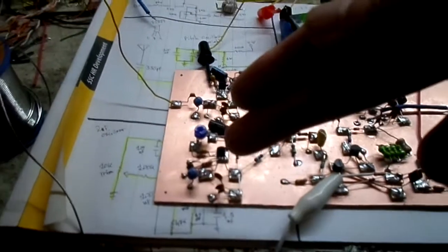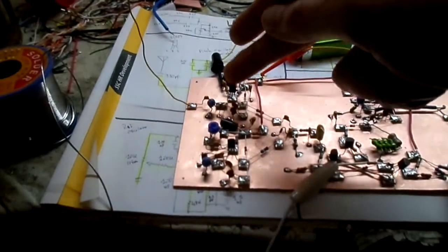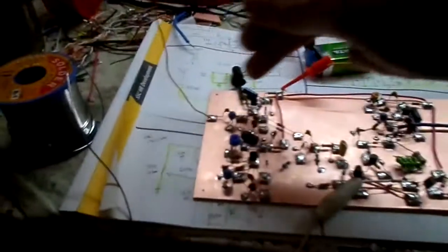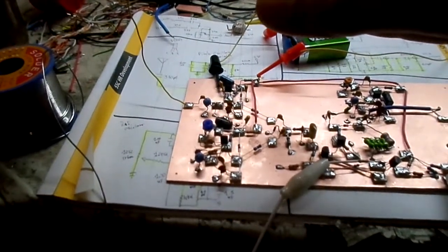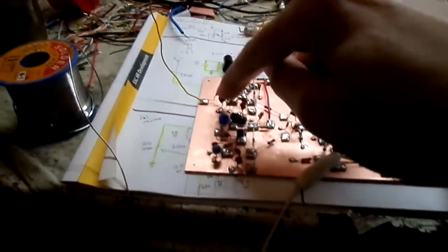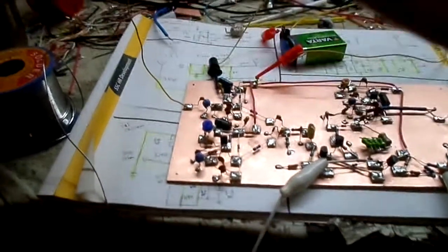The left side here is going to be your pitch oscillator. This top part, the upper left, is your pitch oscillator with the antenna. It's basically a tuned circuit for, I'm going to say, about 250 kilohertz. I might not have the correct inductors. They call for 2.2 millihenries, and these are about 2. So yeah, I'm going to go with that.